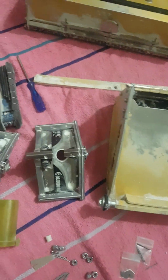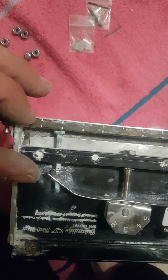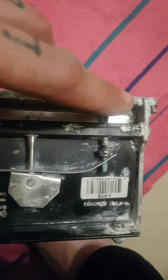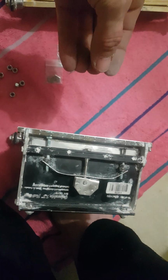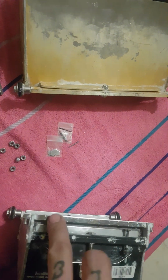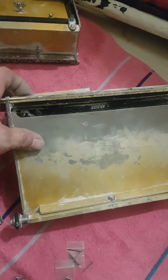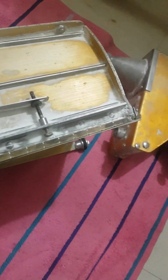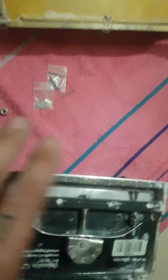All right, so compared to Columbia, they use a flat stock of stainless to sandwich that rubber that's attached to the bar. All right, now they shove these Allen heads here that you've got to unscrew to take this plate out to remove the brass bar. So if I was to buy a Columbia bar and put it on my Tape Tech box, I'd have to drill some holes for those screws that you've seen on the Tape Tech version. All right, because these Allens are brutal. I do not like this design.